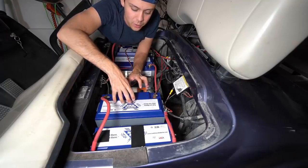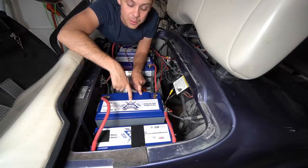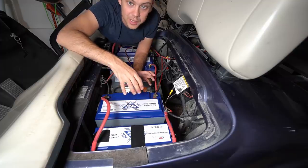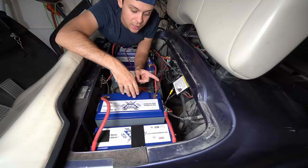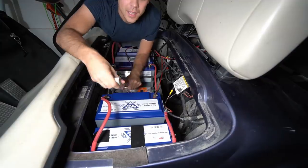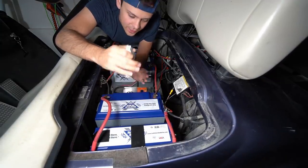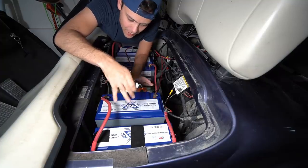The first battery I wanted to try was Battleborn, because these have a max surge of 200 amps for one second, so I figured they would work great — but I was completely wrong. The moment I tried to turn it on, the initial inrush surge put two of these into safety mode. I even used a pre-charge resistor for that initial inrush and it still went into safety mode, so I need to take these out. This was a bad idea.